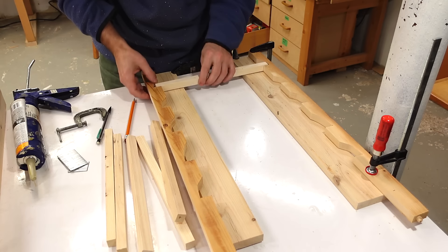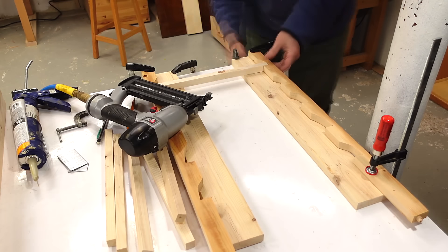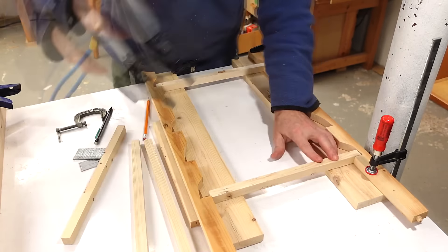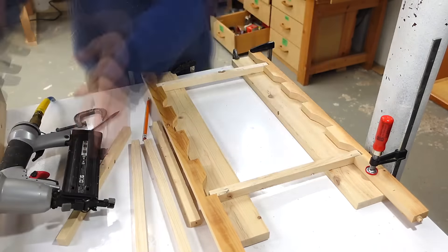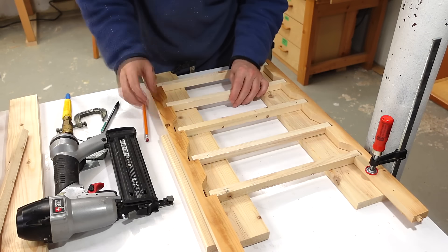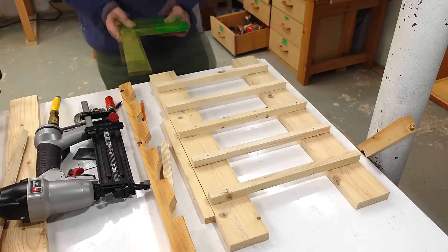Because this is more of a thing for just storing boxes in the basement, I decided to make this one a bit quick and rough. So I didn't even plane my boards after resawing them, partially to preserve thickness, and I'm using construction adhesive because that's much better at filling gaps, and just nailing it together with a brad nailer.